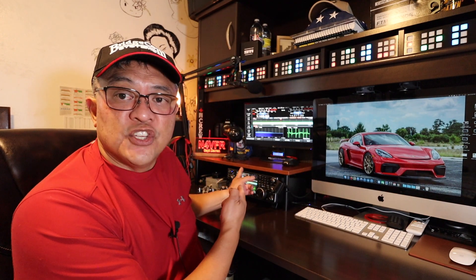So what am I going to do to combat this RF interference? Number one, let's find out if the source of interference is coming from this house. I'm going to operate my HF radio via battery and I will shut off the main circuit breaker to the house.